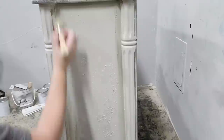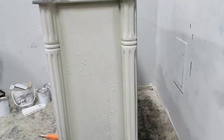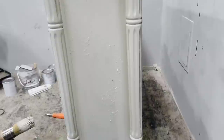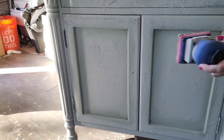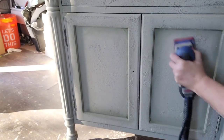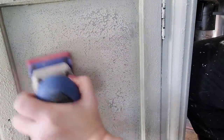Here's that soft sage green — a really pretty contrast against the white, just that light amount of shading I needed in the corners. I'm going to emphasize all the shading with waxes, but having the paint underneath makes it much easier. This part is pretty fun — it's already less scary than the last phase. I'm taking my Surf Prep sander with 80-grit paper and sanding back all of that texture to get it fairly smooth — enough that running your hand over it doesn't catch on anything, feeling smooth like clay pottery. This knocks down the texture and starts to expose the darker color underneath.